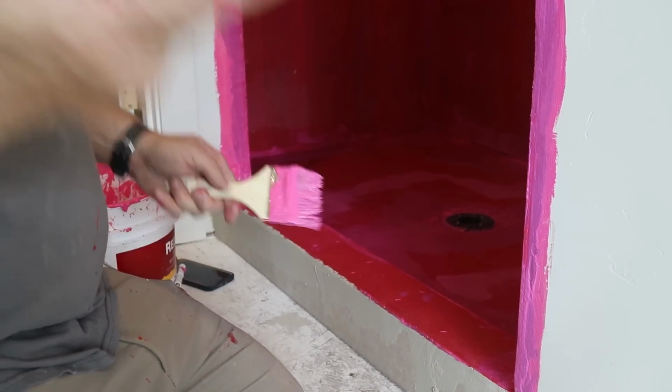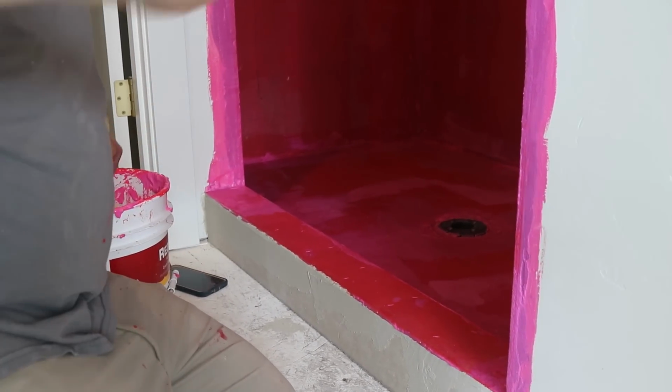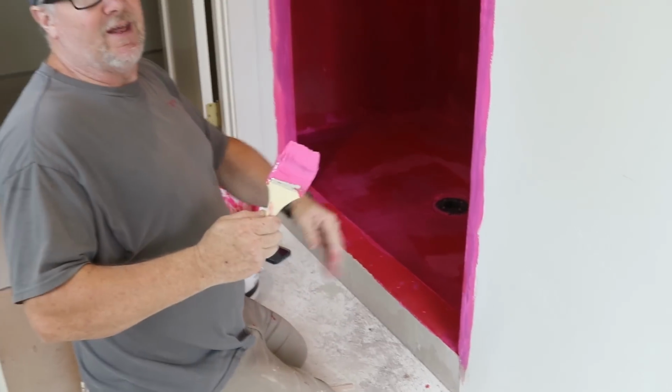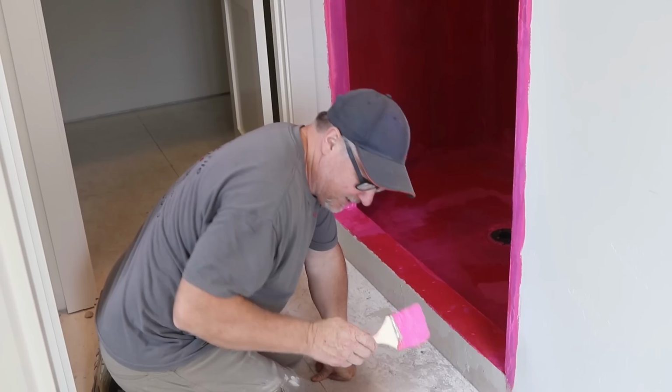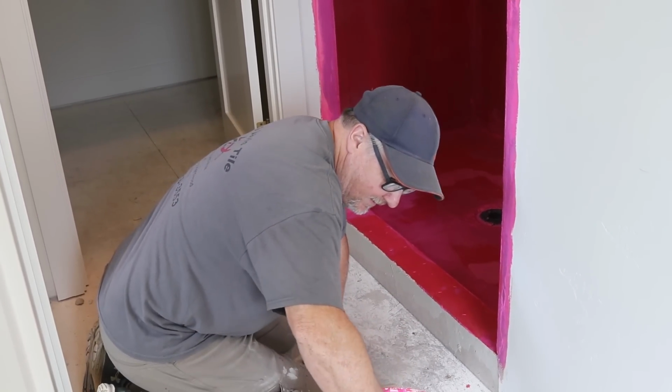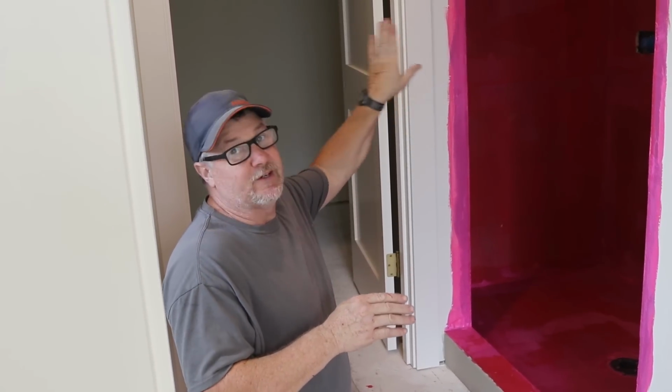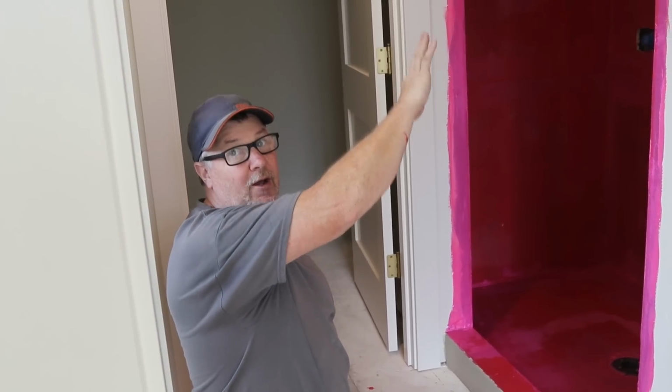Back then, tile, especially California, and probably Arizona too. Yeah, probably do a lot of tile. That's what you do. So everything was floated. They would do the sand and cement mix, and then just float your whole house. So how did they waterproof the showers? They would sheetrock the showers, and then they would tar paper the showers, and then they staple chicken wire onto the walls. Oh, got it.